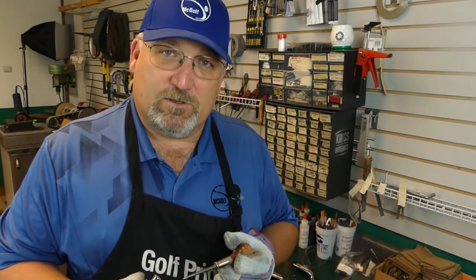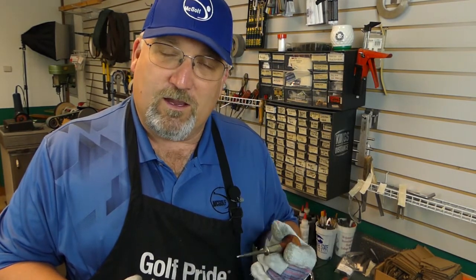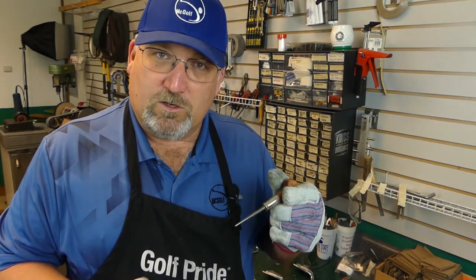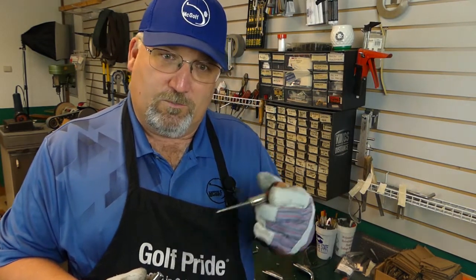Well, number one is if it's brass or lead, you could probably drill it out. Now, that's time consuming. You start with a smaller drill, so you get your center, and you just keep working your way out. Eventually what should happen is you create enough heat that it breaks the epoxy bond underneath and it pulls out with the drill. That's a sometimes yes, sometimes no.